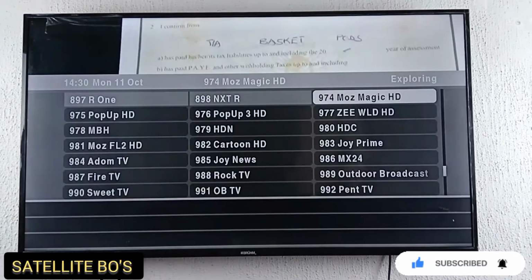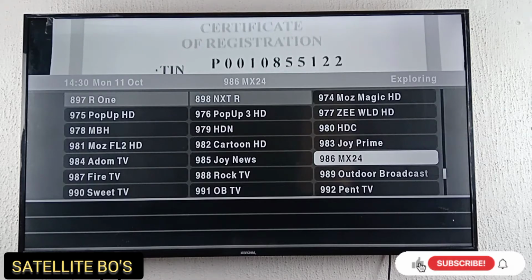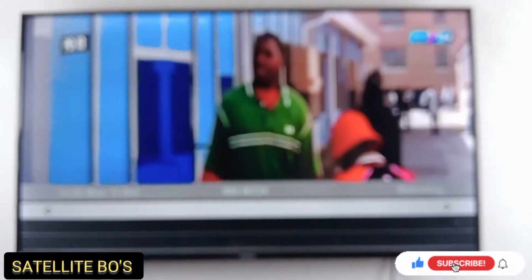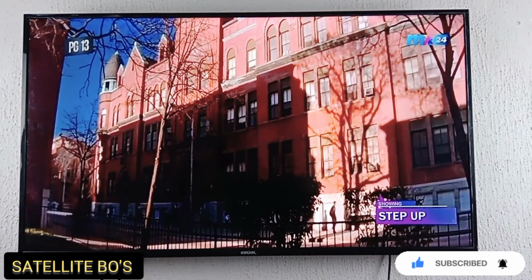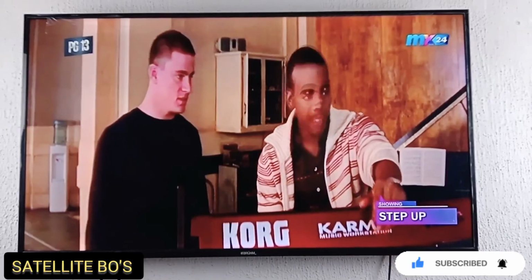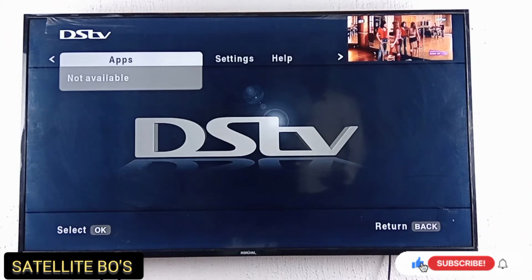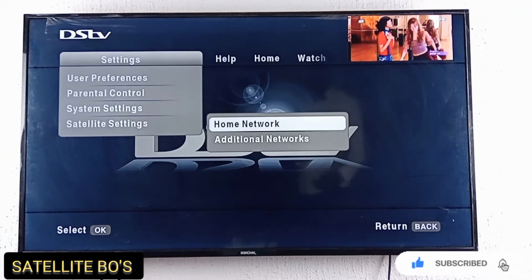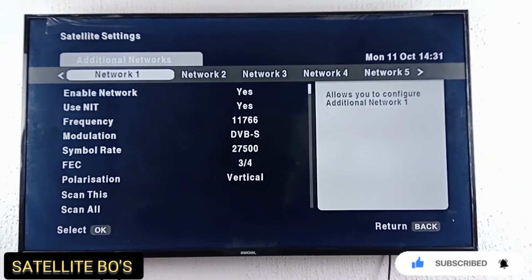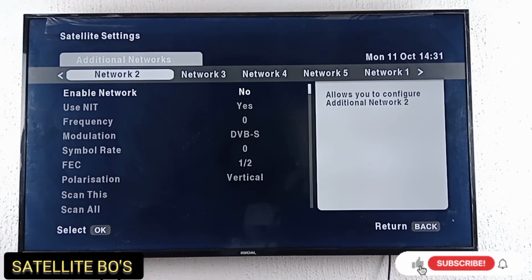Now, go over your channel grid. Keep checking all these other stations. MX24. See? All right? So, now, having done this, return back to the settings. We just inputted just one satellite now. Now, return back to the settings and go back to that satellite setting, to that additional networks. That's network one that we fixed. Now, go to network two.